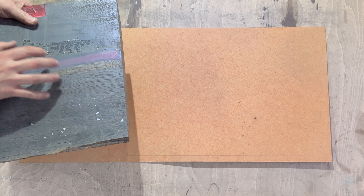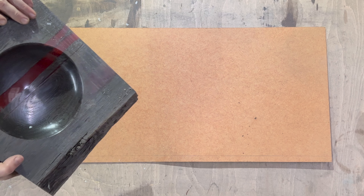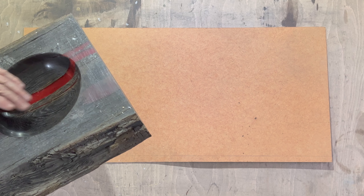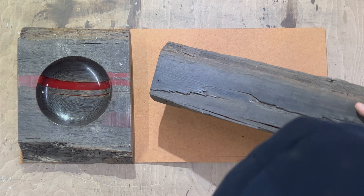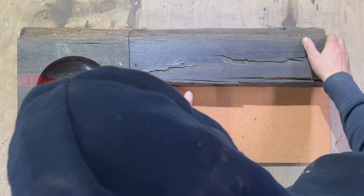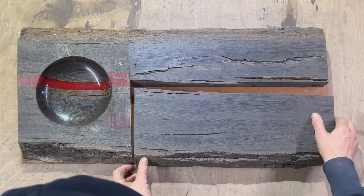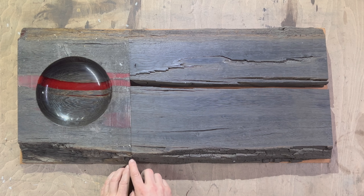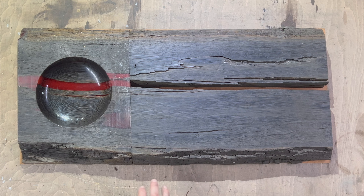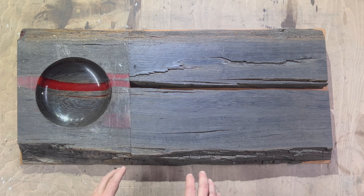A piece of pre-cut hardboard — I planed off most of the hardboard on the back of that piece — that's all going to be sanded beautifully later. A little bit of resin left on there. It's got some sawdust and some resin shavings from the planer — that goes there. This needs to marry up to here, this one needs to marry up to this side. I've not tidied up this outside edge yet, because if there is a slight disagreement in the meetings I can cut it back with the wire brush on the grinder. I think this is going to marry up really well — I think a dry fit is in order. Resin up through here and up through here is going to look lovely as it spreads down across.